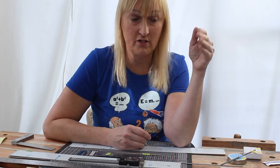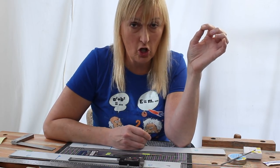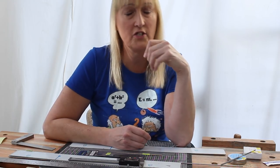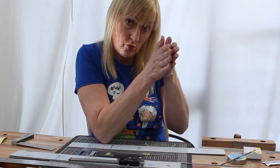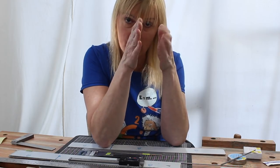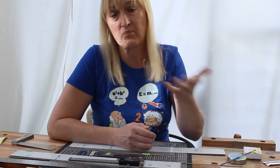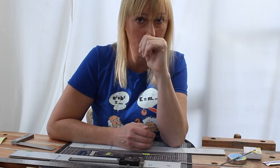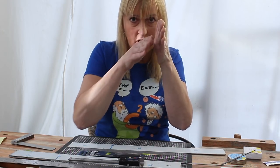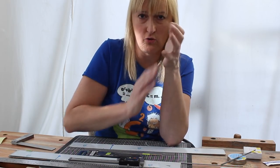So what this means is that, say, on the E string, with the nut compensation you've introduced, you've actually pushed the nut closer to the first fret by 0.5 millimetre. This can either be achieved using shims against the nut, glued to the nut, or a new nut is created which overhangs the fretboard so you can effectively bring the nut forward. Or people have actually shortened the fretboard in order to achieve this, maybe by as much as 1.5 millimetres at the bass end, either with a slightly slanted nut or the whole fretboard has been shortened. Then you cut into the nut more at the treble side where you need less compensation, and perhaps you don't cut into it at all at the bass side.